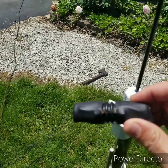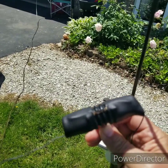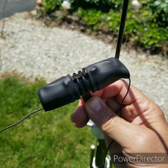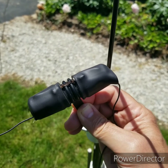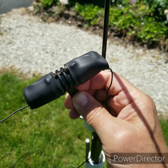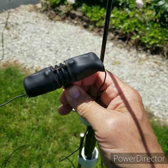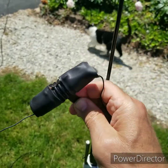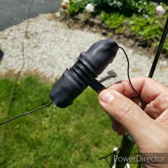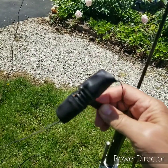That's how I made the center of the doublet. I took a red-hot hacksaw blade and plunged it through the middle of a plastic dog bone antenna, then used a small drill bit to router out the rest of that, put the TV twin lead through it, and attached it to the wires coming in from each side. I covered the whole thing with shrink insulation on each side to hold everything in place so it doesn't slip. This gives a lot of strain relief, so it's perfectly secure — you don't have to worry about wires bending or being strained.